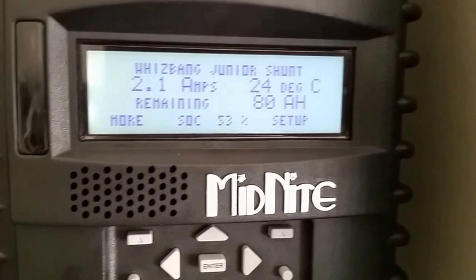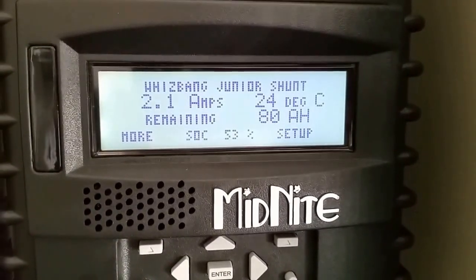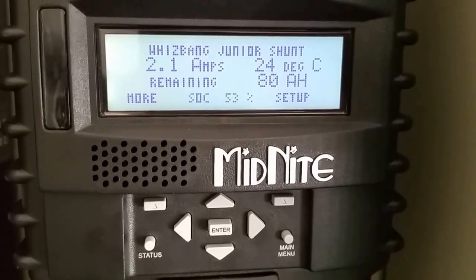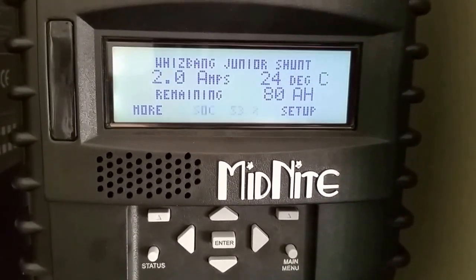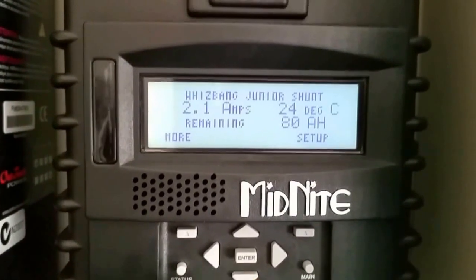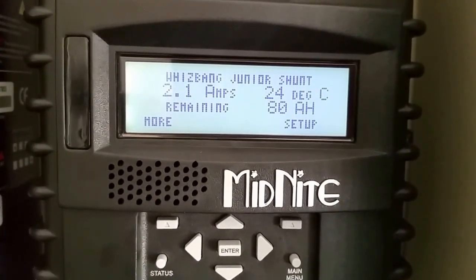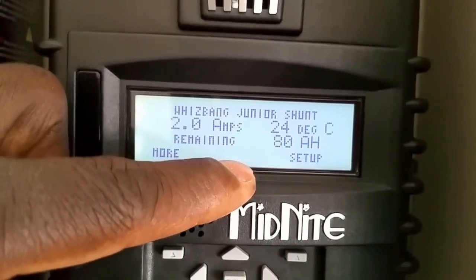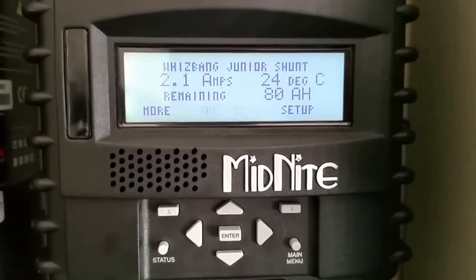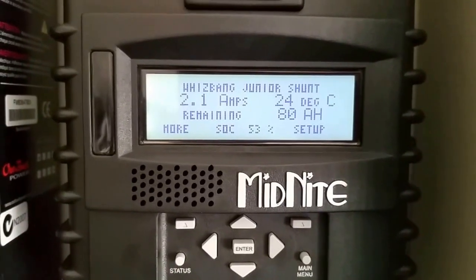And right now, remember, we've been altering the system yesterday because of adjustment and the panels, so the batteries didn't get enough charge. If you look at the test one on the 48 volt system, you guys can see exactly. So the system was interrupted for hours, and so we're still reading the batteries according to what they were doing. My Classic is set up to reset after the batteries get to 100%, then it's gonna erase this number here, and it's gonna be 100% of the battery state of charge. And this one too says about 80. That's not accurately read, because the system has to go on a full charge, 100%, to reset that.